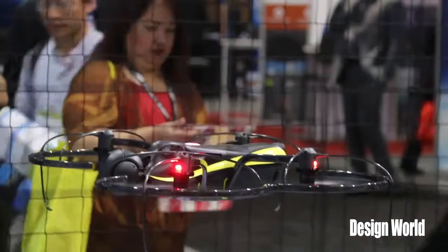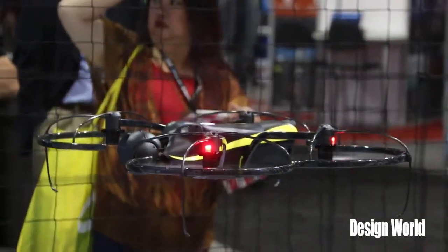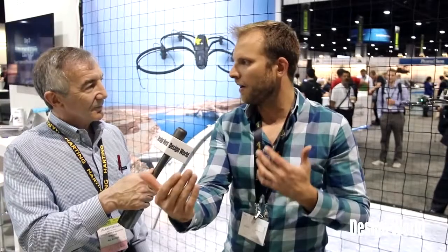The other important thing is to be able to get up close and personal with structures. You can't be flying 40 meters away and try to find that one millimeter sized crack — you really have to get up close. We're trying to make the job easier for a civil engineer to get his camera a meter away from the surface he's inspecting. For this, we have a lot of integrated sensors in the drone.